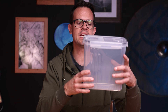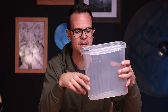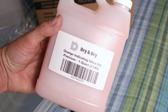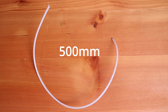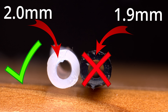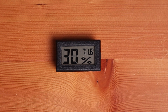For the materials, we're going to need a cereal container — I built these specifically for these containers, and I'll have a link in the description. You'll also need four 608 bearings, some desiccant to keep everything nice and dry, a PTFE tube adapter, and some PTFE tube — I like to use about 500 millimeters of the 2 millimeter inner diameter. Make sure you don't get the smaller stuff; you want it a little loose for when you're feeding out. We also need to print the base, the desiccant lid, two rollers for the roller assembly, and optionally a temperature and humidity sensor.